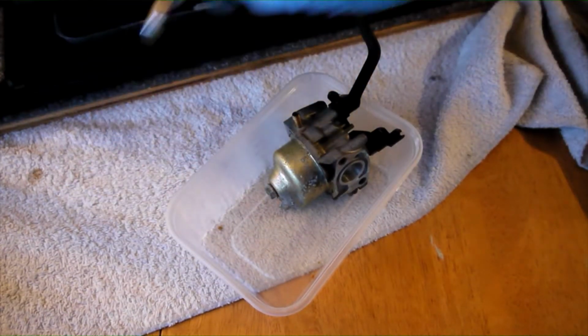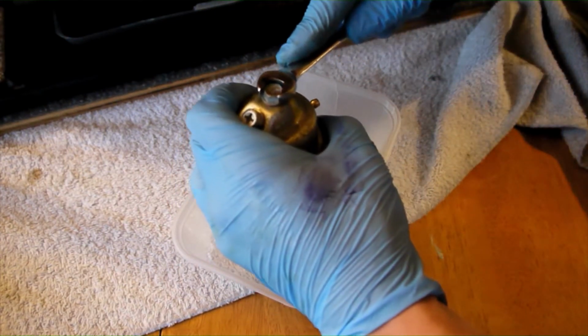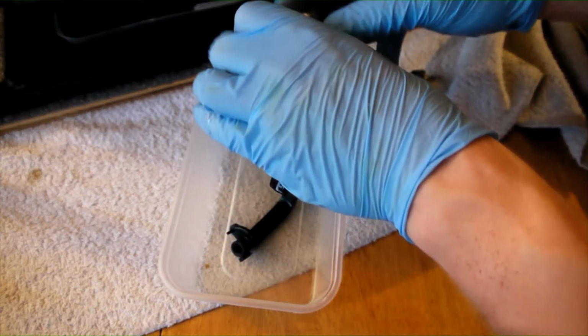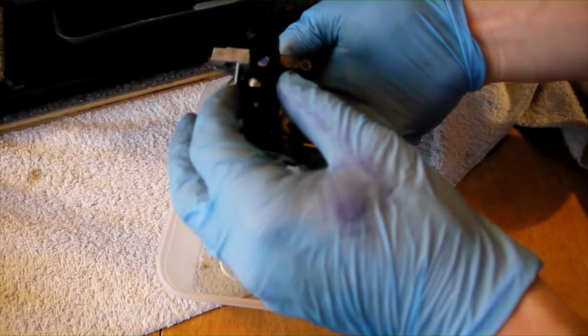Most problems with carburettors stem from poor quality or contaminated fuel. Ethanol-based fuel is hygroscopic, absorbing water. The water then causes corrosion and therefore introduces contaminants into the system, clogging the jets. It is vital to clean and check the carburettor on an annual basis.